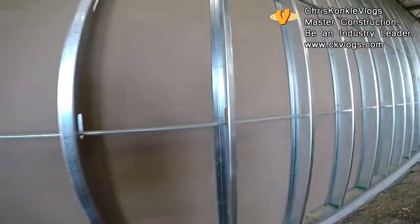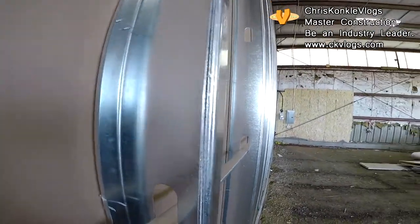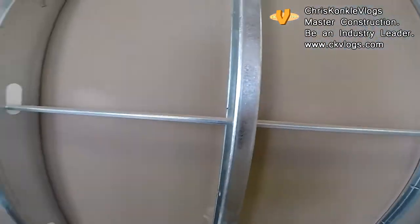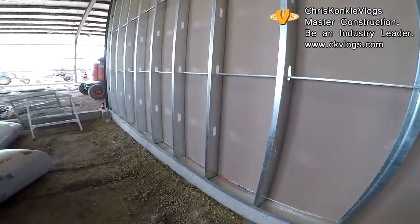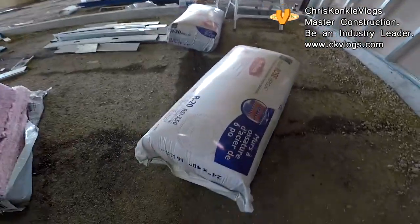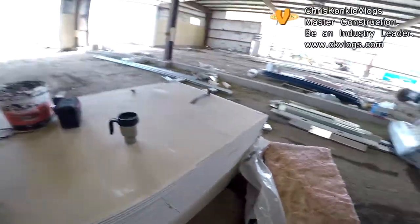Today I'm going to show you a few tricks when it comes to insulating. We're using R20, which is for six-inch walls. It says R20 for steel stud on 24-inch centers. With steel stud, the insulation has to go inside of the stud, whereas on wood it stops on either side, so it's a little bigger than the furring wood. There's no top or bottom side to the bags.